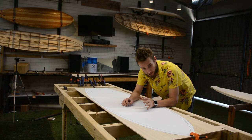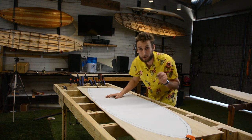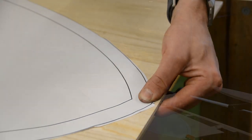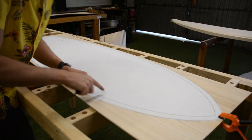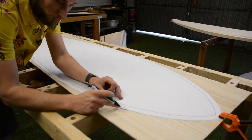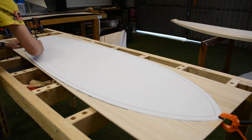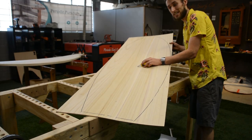Working with the paper template is the next step. Here you can see I've got the paper laid out onto a deck skin which I glued up using the methods outlined in our working with thin stock video. I've got the paper laid out so that I have the center line, which is where the apex of the peaks are on the center seam of our glue-up here. That means that we should have a nice straight grain pattern on our board. Once you're happy with the placement of your template, you can come in and trace the outline. Usually I would do this with chalk, but I'm using a permanent marker here so you can see it in the video.